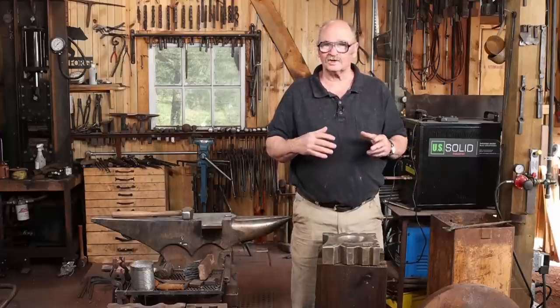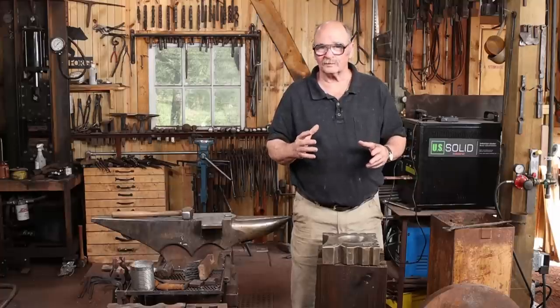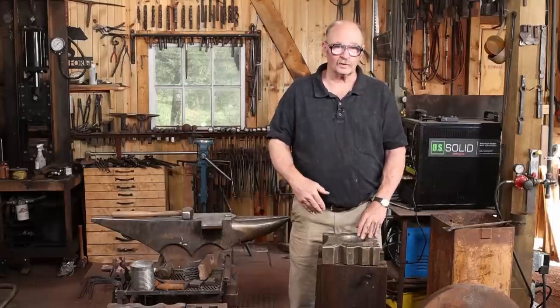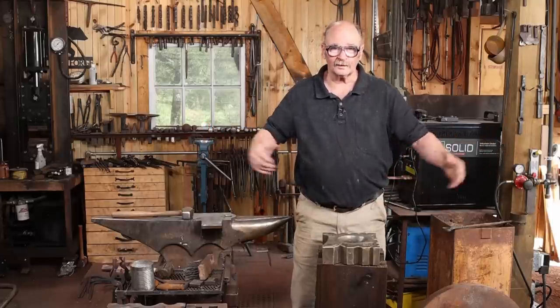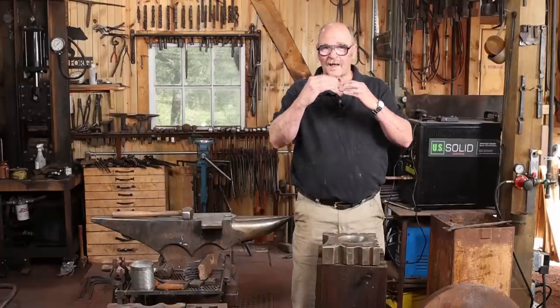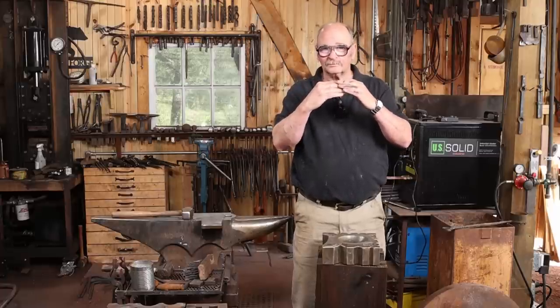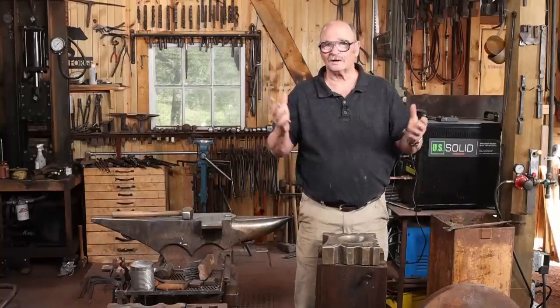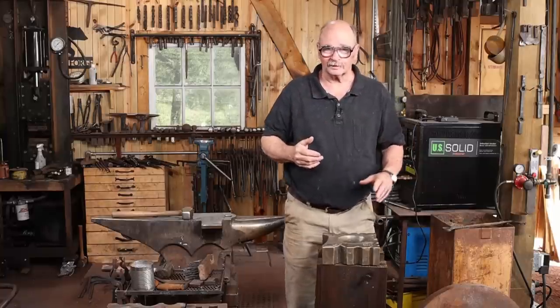Because I'm doing a lot of shop improvement videos this summer, I'm not doing as many forging videos. So let's go ahead and forge this band. I'll cut it full length, wrap it around, do a little upset end with a half lap joint to join the band together on the end, and that should look a little bit better, and we get a little bit of a forging exercise out of the deal.